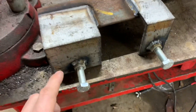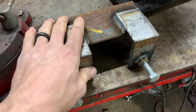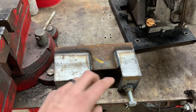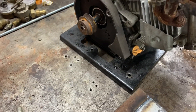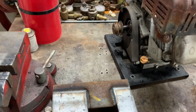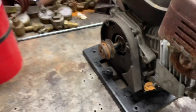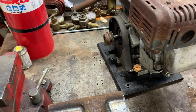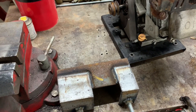So this is what we've got so far. I've got the nuts welded on the bolts and this will cradle over the edge of the frame. I'll tighten these bolts down and it'll clamp to it. What I'm going to do now is get a piece of pipe and weld it here and here in a line, and then there'll be a piece of pipe that fits in between that will go on a piece of quarter-inch plate. That plate bolts to my power washer so I don't want to mess it up — this will bolt to it and act as a hinge. I'll have a bar coming off of it so I can pull extra tension to get it tight against the belt to start it. I did find a small pulley and got that on it. Now I'm figuring out the rotation of the other motor so it actually spins the right way.